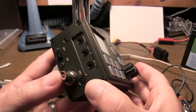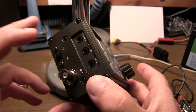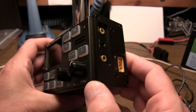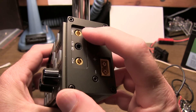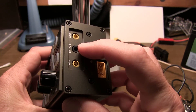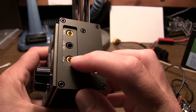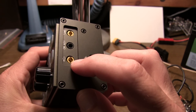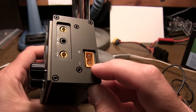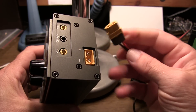On this side of the rig, we've got the antenna connector, the connector for some external headphones, an external speaker — although the internal speaker works quite well — and then the connector for the hand mic and on/off switch. On this side of the radio, you've got a connection for an external optical encoder if you want to use a larger tuning knob. It's got a connection for the CW key or set of paddles, and this is actually a USB connector. It comes supplied with a cable that plugs into this TRS-style jack with a USB plug on the other end, and it uses the XT60-style power cord, similar to what you'd find on RC vehicles — a very sturdy connector, and you just make up your own power cord.